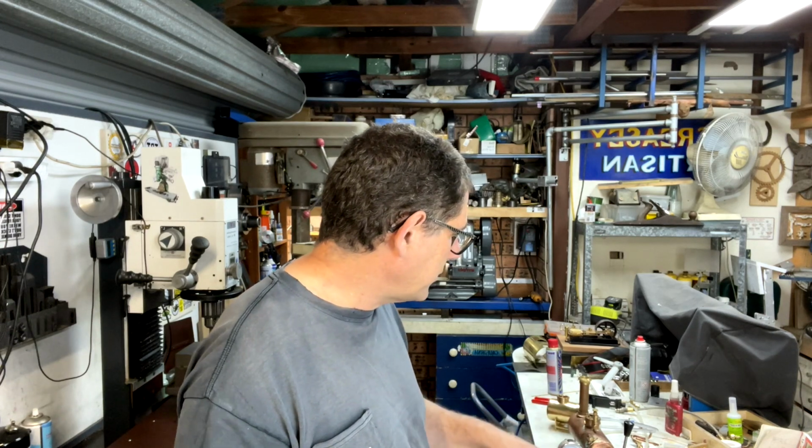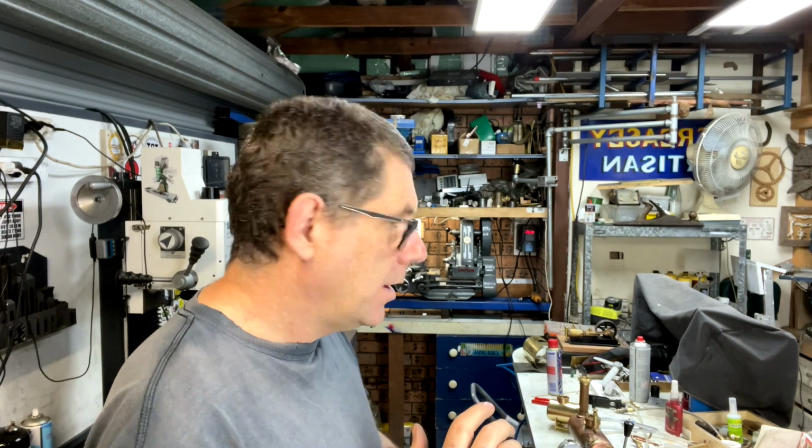So I wanted a valve because I'd pressurize it, and I think just the back pressure, the pressure in the system would just sort of seep past the stop valves, and it would hold pressure, but it would fairly quickly release. I couldn't find any leaks on the boiler, so I was pretty sure it was just coming back through the pump. So I put a valve on that, and it still does it, but it does it much more slowly. No system's perfect. I've got to stop at some point, and I might have to actually fire up the boiler very soon.